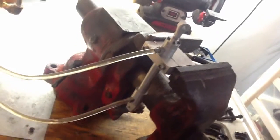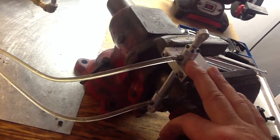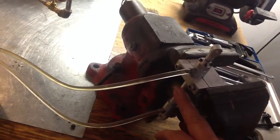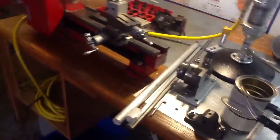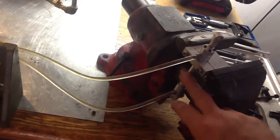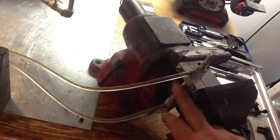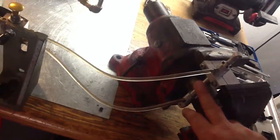So the cylinder is here. It's a 3/8 inch bore, and I think the outside diameter of this part is 0.70 inches — 700 thousandths. And then this is, I think, half inch outer diameter there, and again a 3/8 inch bore. This is a composite piece. My lathe is pretty small and I can't do a bore this long on it, and I don't even think you could bore a diameter that small — generally you've got to be boring stuff that's kind of like a half inch or bigger. So what I've done is made a composite piece with a couple different bits and just glued them together with epoxy.